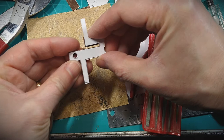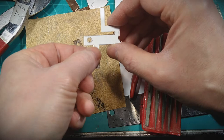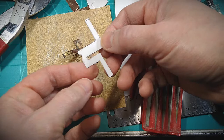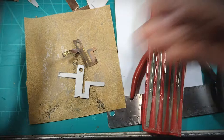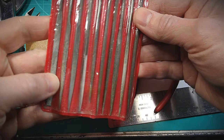My next step is making a paper template of that broken metal contact strip, adding in and allowing for that missing section — the section that broke off from the corrosion earlier. I've taken my paper template and spray mounted it onto the metal to make it a lot easier to cut out as a guide. I used a larger pair of tin snips for bulk cutting, and as I worked into the tighter sections, I used a small pair of snips. Then I used needle files and coarse sandpaper to remove the sharp edges.